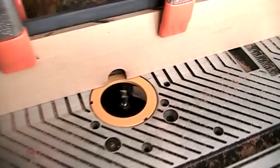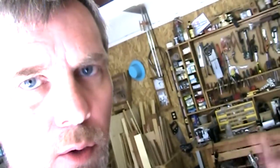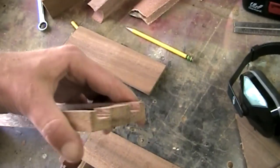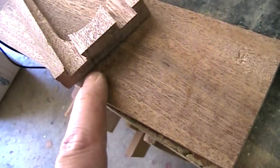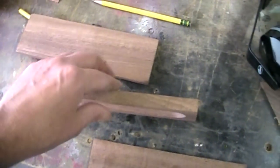I've been in this huge woodworking slump lately where I have just been screwing stuff up. What happened is, for one reason or another — I still haven't really figured it out — my dovetail bit wasn't really firmly attached in the chuck, so it was just kind of moving up and down. I'm glad the thing didn't fly off. I was lucky I was wearing safety glasses. Some of these cuts were going down deeper than others and I just couldn't figure out why. So I ended up cutting off part of this and recutting those dovetails, and now it's going to be a crochet hook holder because I went around the house trying to figure out things that could fit in there.